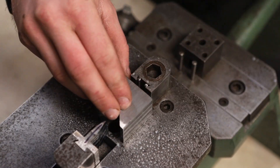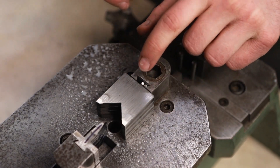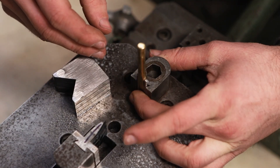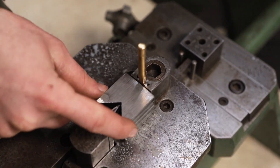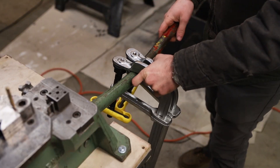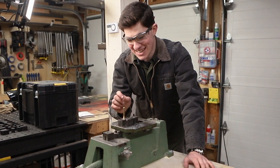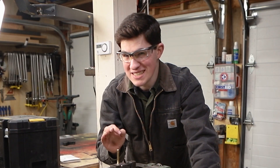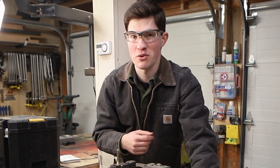I'll stick in the round bar, put the die on, put in a little shim to kick them forward, stick in a brass wedge — and that wedge isn't loose enough to where they can still slide. I put the male die in to center the V. I'm going to hang some weight on the handle. It seems kind of risky that I might accidentally weld to the machine, so I'm just going to turn down my welder light enough to barely tack this together and then pull it off and weld it properly. We'll see if this works — it's just an experiment.